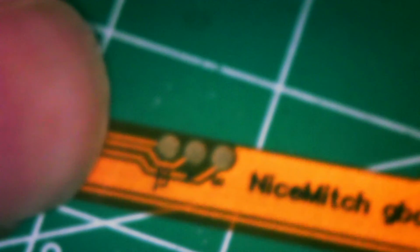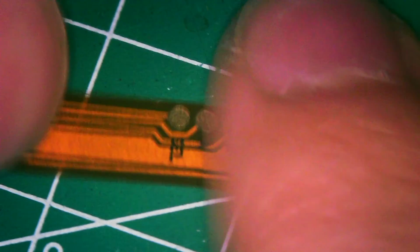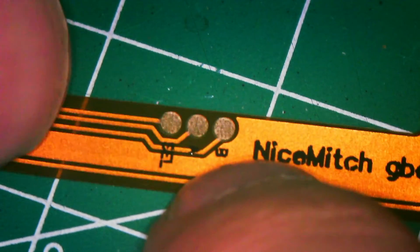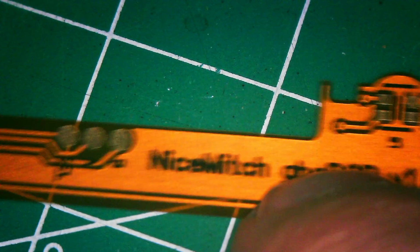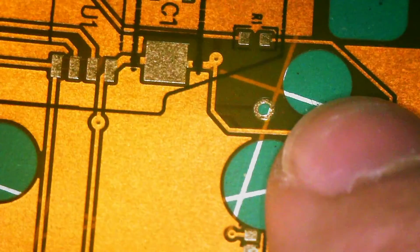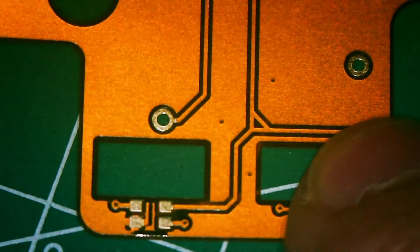There's no wires at all. And that's because I've relocated them. It's in a really easy to solder place. So anybody can solder the wires here. It's a little bit easier and cleaner than soldering to the vias. You don't have to do any scraping or anything like that. And this all neatly aligns on the board. There's some vias that you just solder to. It's a really quick install.